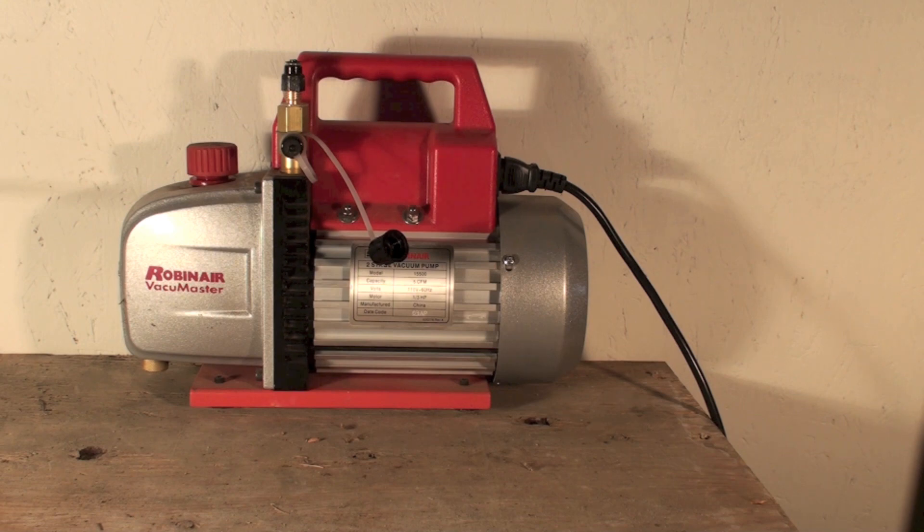There's oil breakdown, even rust inside these systems. So we came up with the idea that we should only have refrigerant and oil in the system. They came up with a vacuum pump. A vacuum pump is just like any other type of pump, except the suction side will pull a very, very deep vacuum.